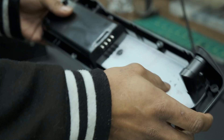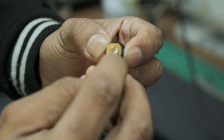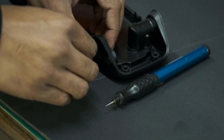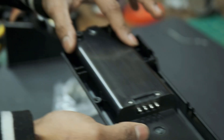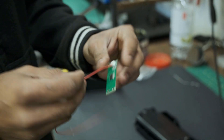Now we can work on the base. These two pins are positive, these two are negative, here we have our switch port, and then our charge port — right leg is positive, left leg is negative, the middle leg is not used. The charge port sits in with the cap over it, the switch goes in, and I'll solder 18 gauge wires from the charge port to the pins. I'll also solder on the discharge wires and add a 48 volt battery indicator with a button that sits inside the case.